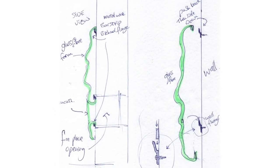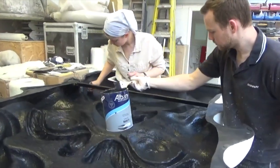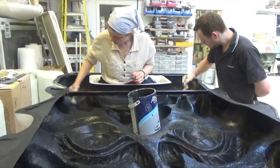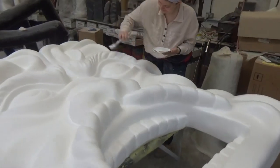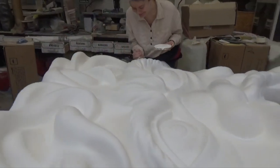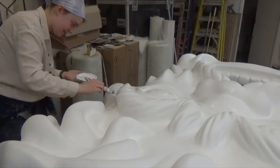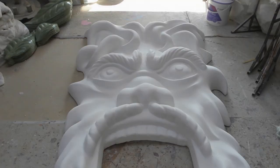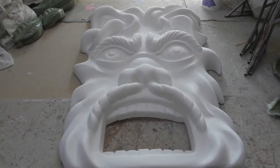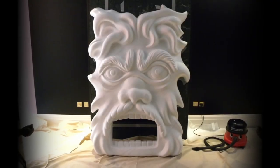The template is so the client has an accurate guide prior to the sculpture being offered up against the wall. Although it will only be seen from the front once in position, the client will undoubtedly see the back — as will anyone installing this for the first time or moving it in the future — so we're making sure we finish a nice clean job over the entire form inside and out. For the artwork we're using a water-based eggshell paint for a more ceramic finish, which works out to be a lot tougher than regular water-based emulsions, and in place of our usual car body paints which would be flammable. For the white marble look, the piece will be transported to site and Aiden will go through the airbrush work with the client — just a very subtle grey vein running through the stone — so that Mrs S can add her own personalized finishing touch.